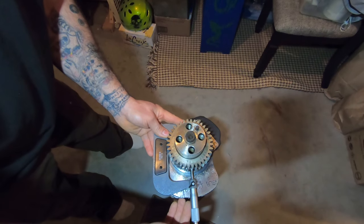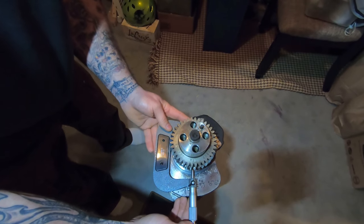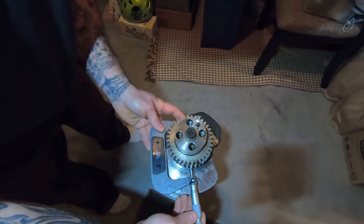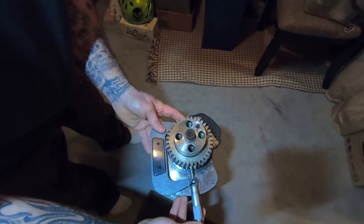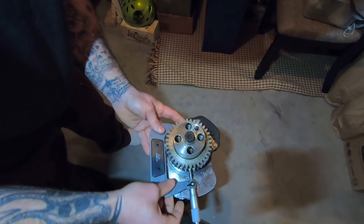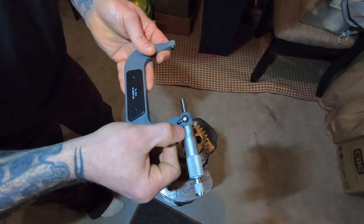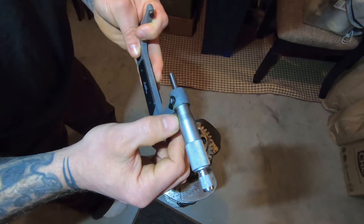So I'll measure the next one down and take the next measurement at the bottom. Make sure you're not on the radius, just feel around — you'll feel the high spot because it'll get tight. Don't force it down any tighter; just move around until you feel the high spot, get right in the middle, wiggle it around, click it, and pull it off. I'm getting 3.268, 3.268.